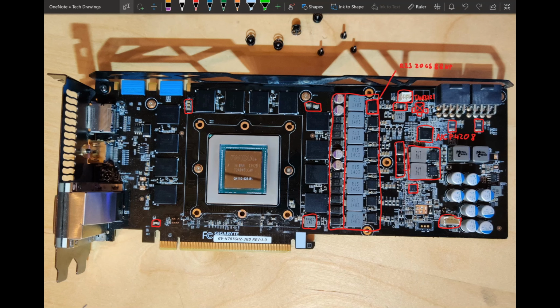But it only worked for like 2 hours before the memory chip dropped in, because I heat gunned it and it came back to life for about 2 hours. But then the memory chips just started erroring out again, and heat gunning it another time didn't work. So those memory chips have to go.